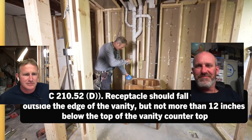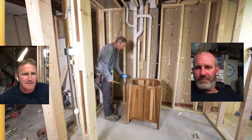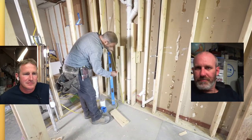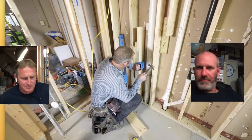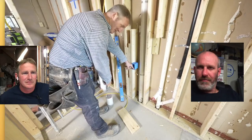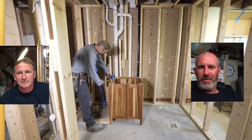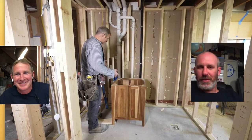We'll place the outlet at about 32 inches to the top — the top of the vanity — and I'll need some framing to mount the box. Eight inches on the other side of the toilet, so the tank will be right around there. If you wanted to put a bidet seat on, you'd have an outlet to plug that into too. I kind of like that idea — having the outlets hidden and not floating around, especially since we want some shelving.